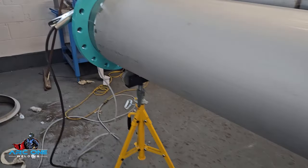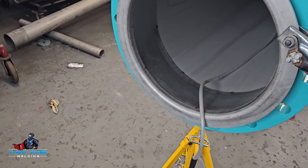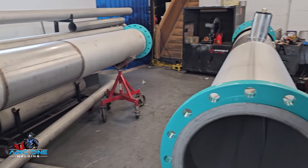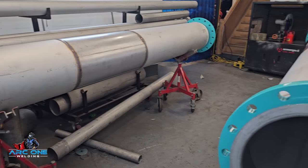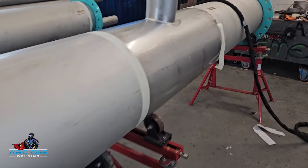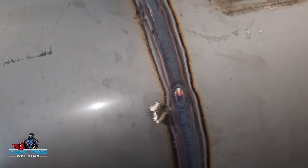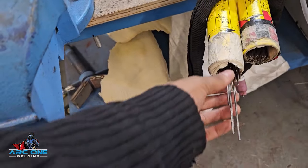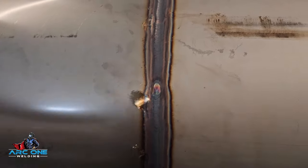18-inch reduced into 14-inch — that's just so big. Here's some work that was done the day before. Don't worry about how messy it is — when you're working your ass off, it gets messy. Here's the first weld — it took about 45 minutes to do. I used five 2.4 mil rods.